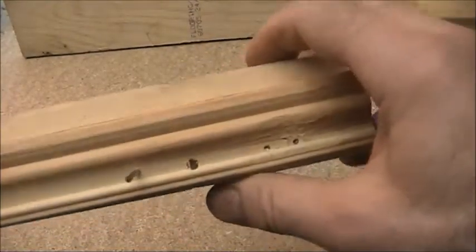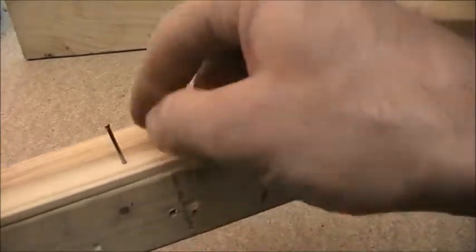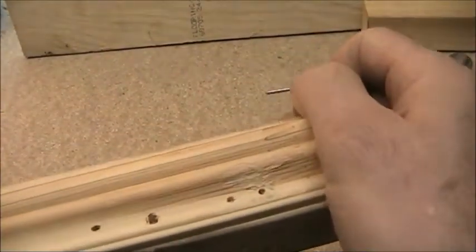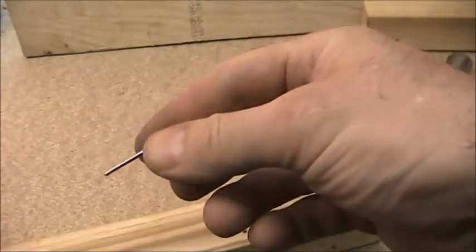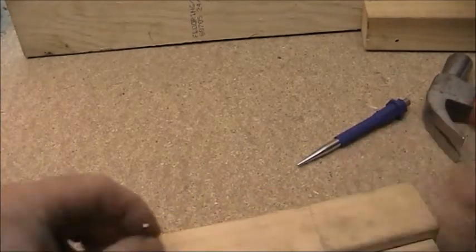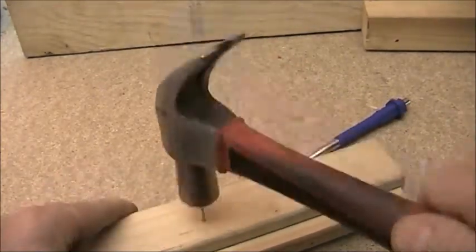So if you look at that now closely, you can see there's absolutely no way the hammerhead can hit the mouldings. It's gone underneath. It's very simple to do with these. All you do is bend it left and right a few times, off she comes. Nail is sunk underneath beautifully, no damage, no marks, and then of course you've got another pin you can use on other types of timber, whatever. What's left over is you can use the pin for other jobs, so it's not actually wasted.